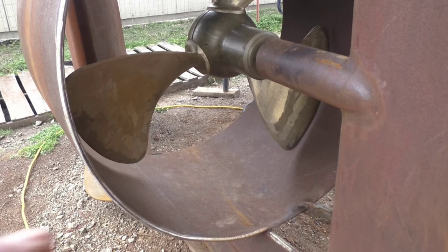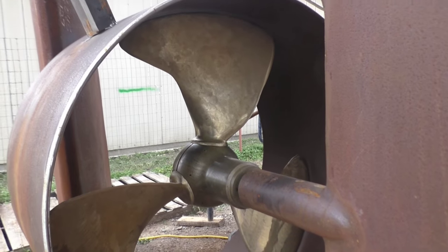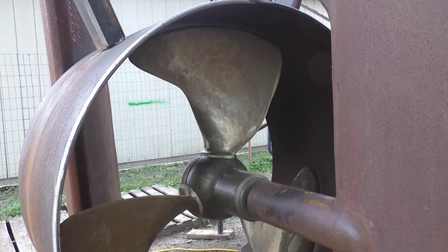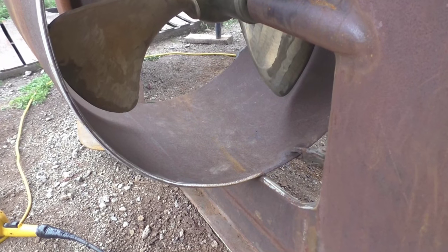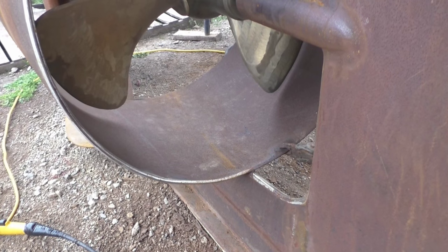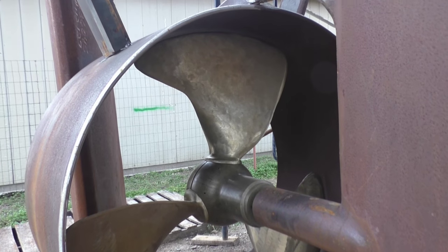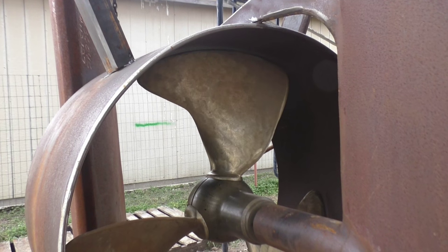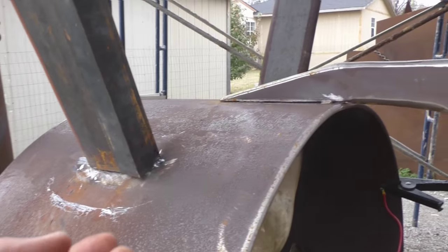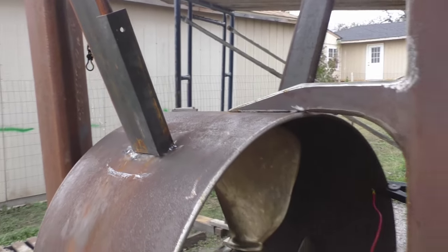We're about an eighth inch off — it's got more clearance at the bottom than it does at the top and sides, but it's even at the top and sides, so I think it's just distortion in the ring. I didn't expect to be within an eighth inch; that's asking a lot, especially since we welded along the shoe of the skeg on both sides — that would have pulled it down on both sides and flattened it. Dave is doing the same thing over there, taking distortion out of a rudder post. We got it to come up by cutting this out, so I'm going to cut underneath this brace and the other brace and see if we can get it to come up just a hair more.